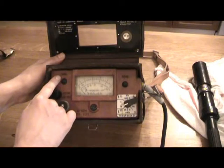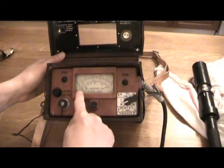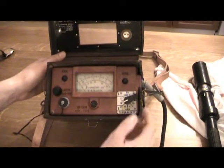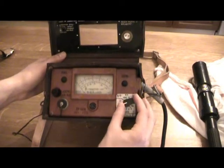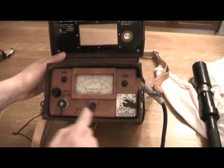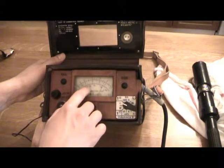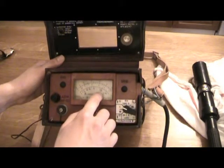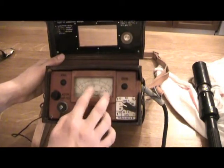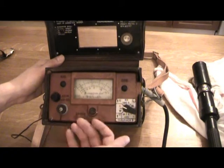Where it says 'KAS' is actually a zeroing control for the meter needle, so if the needle goes completely off to the side you can quickly zero it with that button. And you have the range control here: 'W' is off, and 'K' is the battery check. If the reading is between about 40 and 180 on the meter scale, the battery is good.